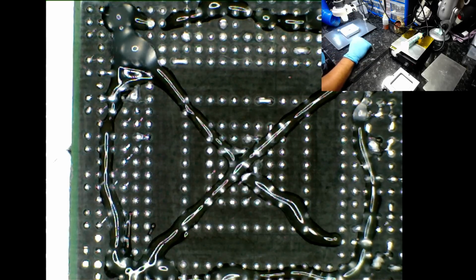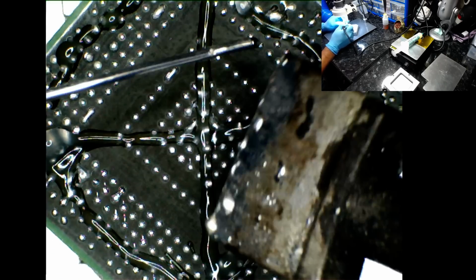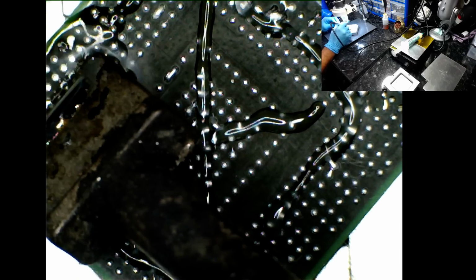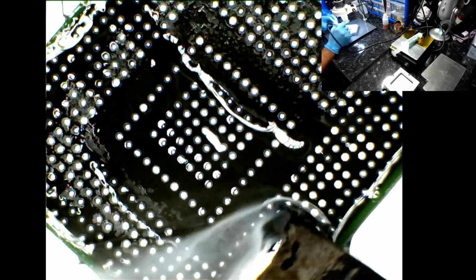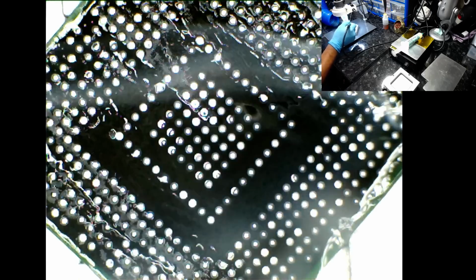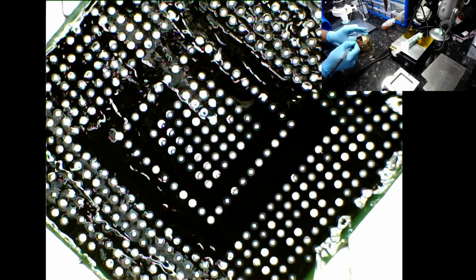Power on the Metcal. Copper braid. And get on with the cleaning process. But before doing that, I'm going to apply a bit of leaded solder. And just gently go over the surface. Very gently. A couple of times. And this should do the magic trick. Let me clean the tip.